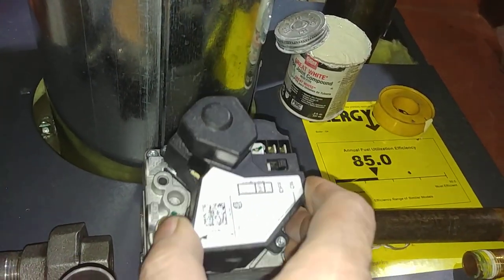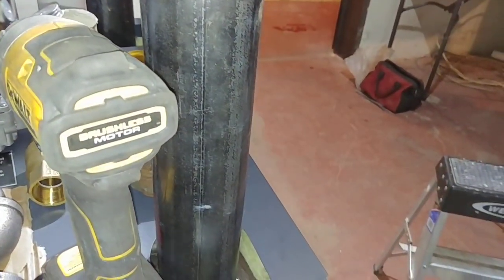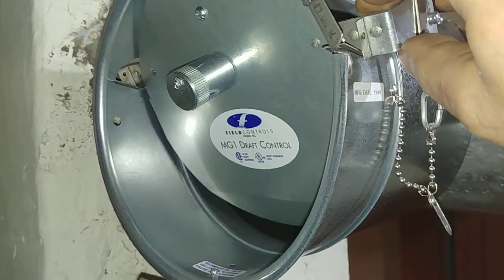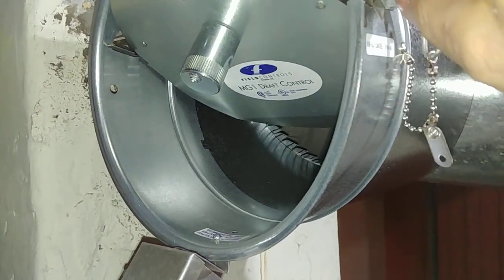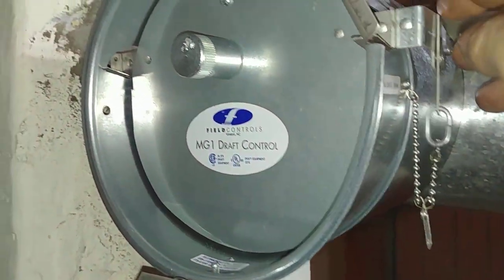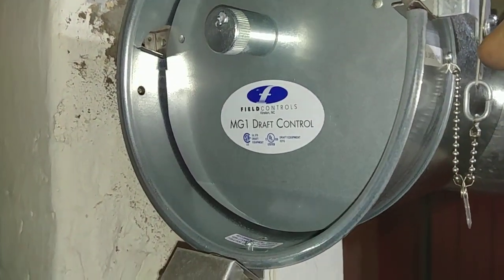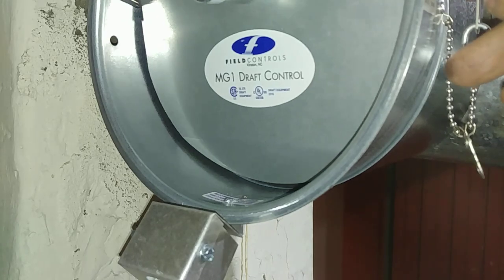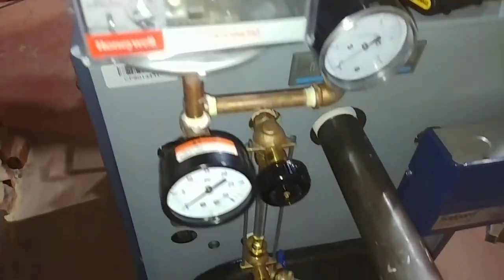This is the valve that comes with the Carlin burner. This is the flue that comes off. There is the barometric, which you need to use with gas — code calls for a double swing. So that goes in like that when the unit is drafting. We've got an eight inch barometric on a seven inch because this chimney was designed to pull draft through a pile of burning rocks, so the draft can get very fierce. We need good draft authority when this operates to ensure a stable draft and decouple the chimney from what's going on inside the burner chamber.